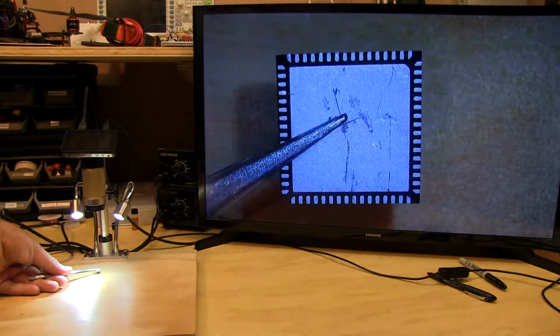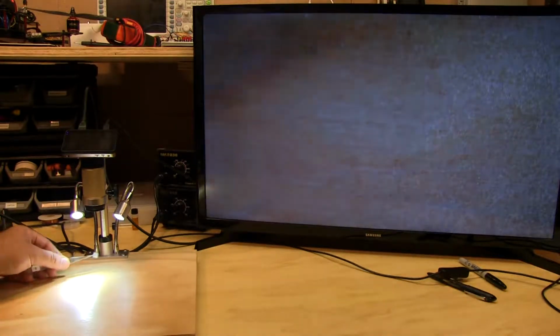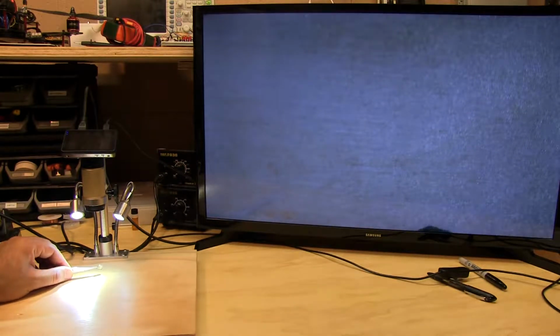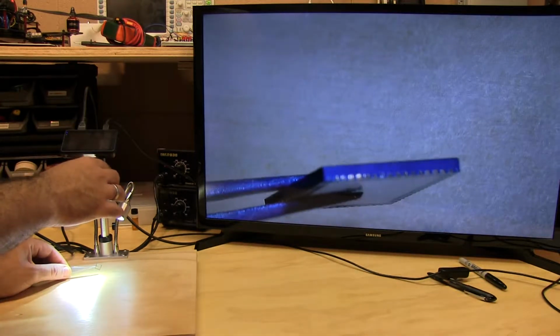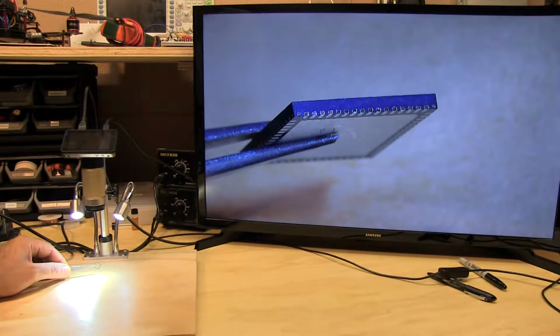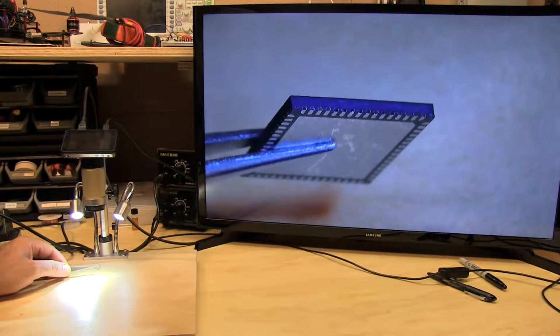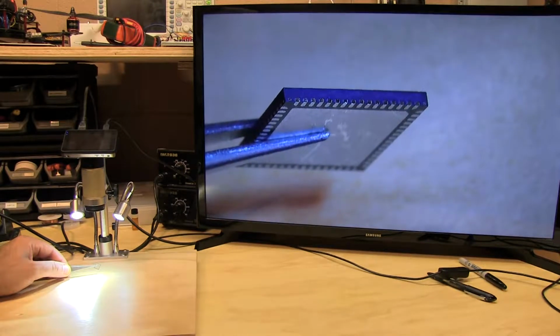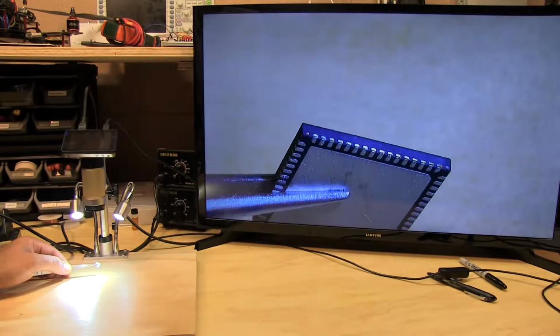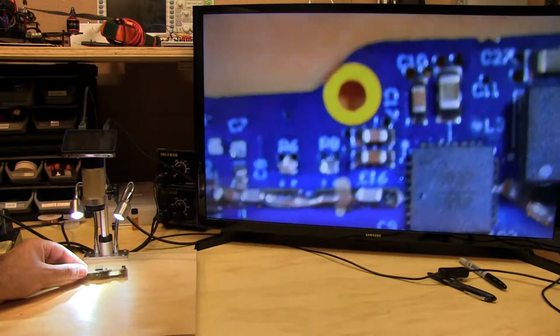A good thing about the QFN package is that each of these leads extends to the edge, and if I can focus this correctly, you'll see a little flash of copper at the edge of the lead here, where it's been trimmed off. This is helpful because it assists in QCing the solder joint once this part is placed. And I can show you that with a soldered down QFN part here.